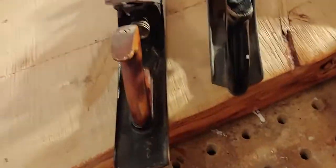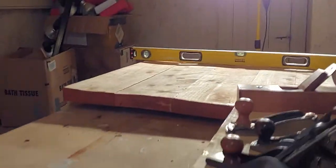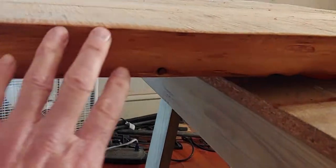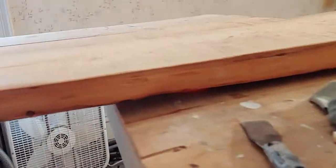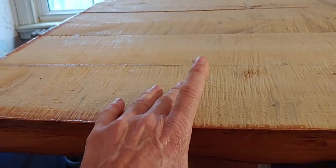And of course the new version Stanley 62 low angle — I might run that a little bit. And I always bring the handyman wherever I go, just in case. So I'm going to set up and do some planing. Let me give you a look at the underside real quick. This is a good natural edge on the face here, it's 10 feet long. The bottom's all finished — it's all polyurethane. It's northern white cedar. What I'm doing right now, the reason I flipped it over, is I'm letting some of the moisture come out of this rough sawn side.